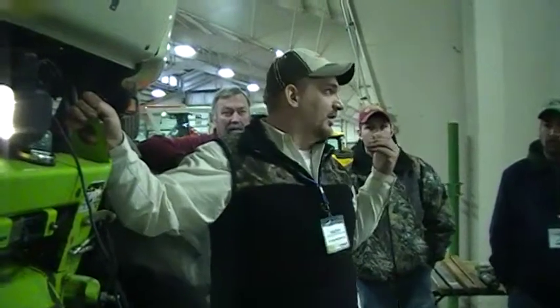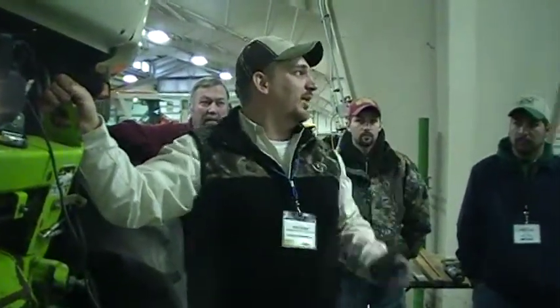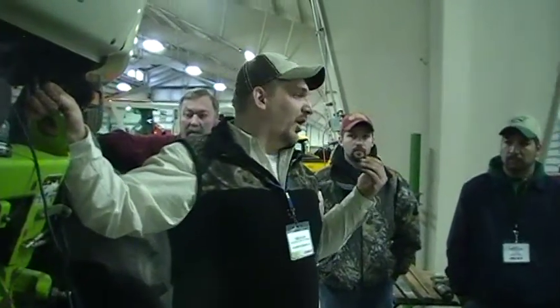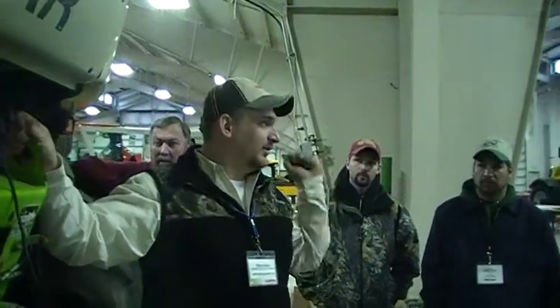So it comes across, advances it, and then grinds back, and then comes across, advances it, and grinds back, basically. Even if it's not advancing for quite a while, it'll still be touching and grinding, just not grinding hard. You'll think it's grinding, but it's not advancing. You want to come out of the cab, stand back, and listen to it. You'll know when it's advancing, because you actually hear it go click, click, click, a positive sound. That's a spot to look at real often and blow out.